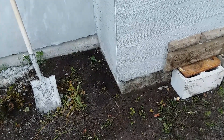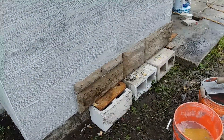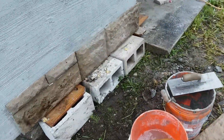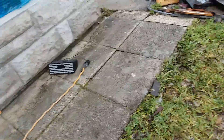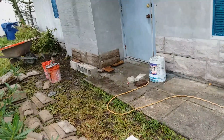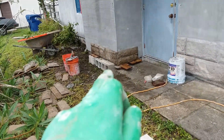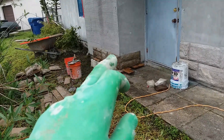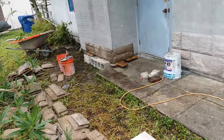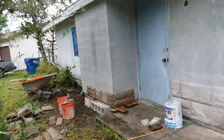If you're sticking stone like this you're gonna run into that somehow. None of this stuff is perfect and it's not designed to look perfect, but it's got to look presentable. You want your corners to look nice and you want everything dead nuts level — that's the most important thing. It'll kill you taking that much time. You get frustrated, you might have to step back a minute. The stone is so heavy it'll be sitting there perfect level, then a minute later it looks like it's sagging. Constantly use that level.